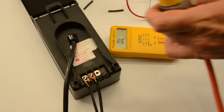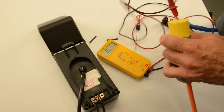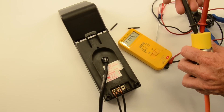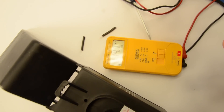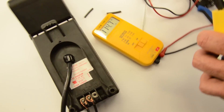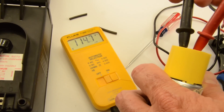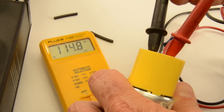I've got the extension cord, the test transformer plugged in, and my voltage meter set up. Today's voltage at this particular time of day, with air conditioners running in this building, is 114.7 volts. Your voltage will change throughout the day — the more load on the system, the lower the voltage goes. In the middle of the night you might find your voltage is 120 volts. Voltage into a transformer will definitely affect voltage out.